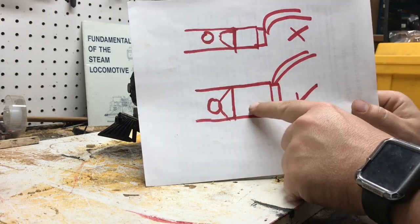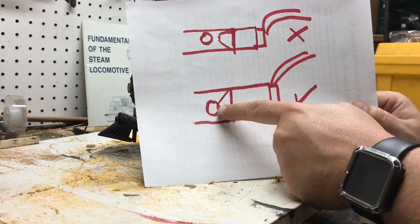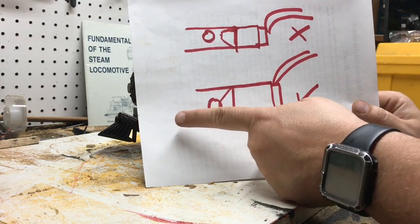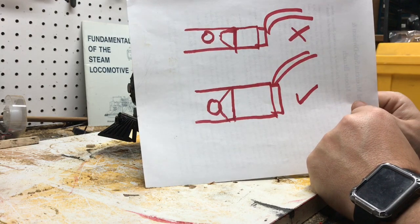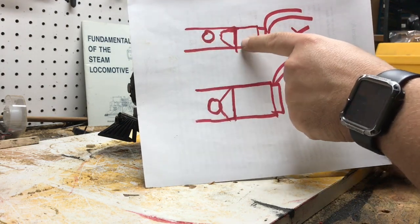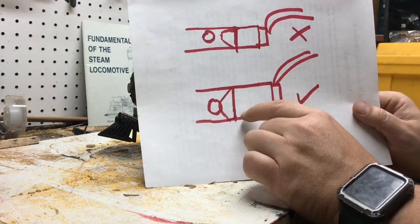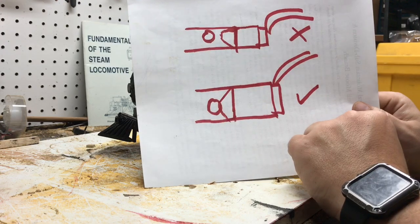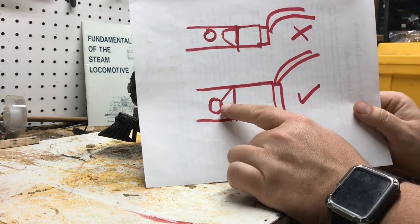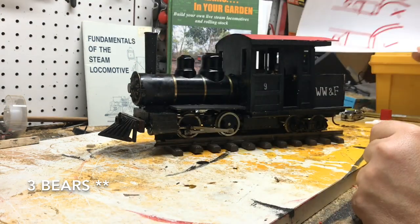As your gas comes into the fitting, because this is screwed out, the mixture ratio going down your burner is a little bit better. It's a little bit richer. Before here is too much air and not enough fuel, and past here is too much fuel and not enough air. So it's kind of like Goldilocks and the Three Bears. This is kind of a sweet spot in the area here.